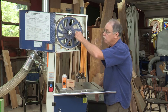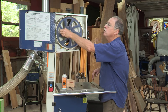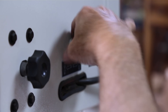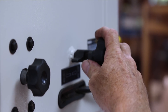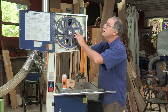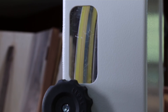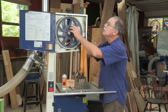It's already been released below the table. What you do above the table with the bearings, you do below the table as well. Now, to track the blade, you'll unlock the blade tracking knob. If you want the blade to come forward, bring the knob towards you. If you want the blade to go back, you crank the knob away from you. The very center of that blade needs to be on the very center of the top of that crown of that band on this wheel. That will make it stay there as you make the cut.